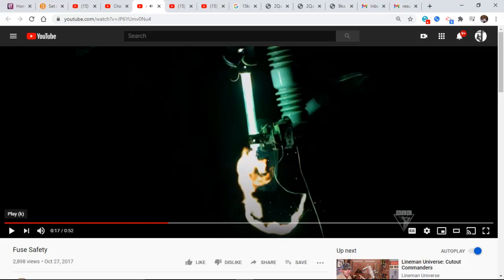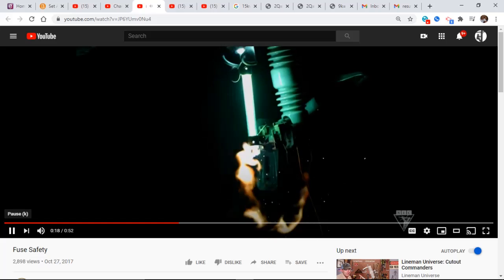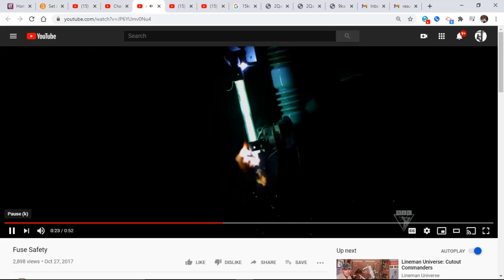Path of electricity on the circuit. Okay, and you see the tail of the fuse, it's whipping. When you see this arc area going all the way through here, power is still on. Air is conducting electricity all the way through this area. Once the barrel completely opens, then extinguish the arc inside the barrel. The hot gases shoot straight down towards the worker and can cause injury if the appropriate precautions aren't taken. Once the barrel completely opens, then you know you've got a de-energized condition.